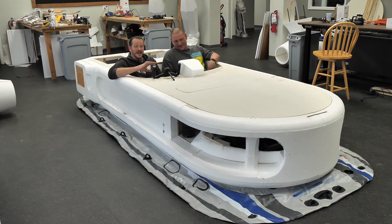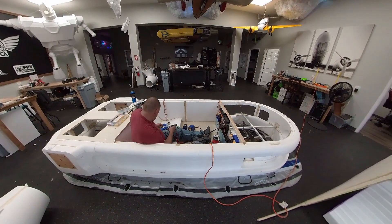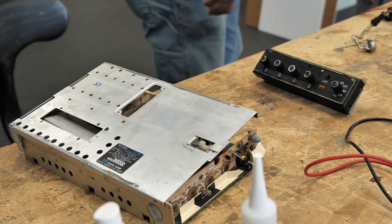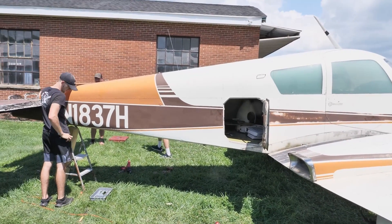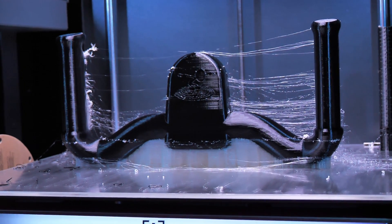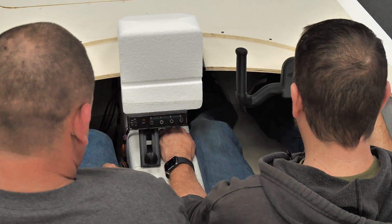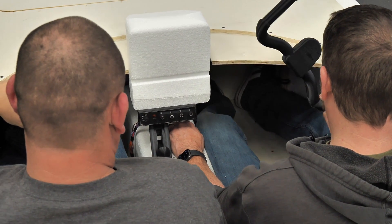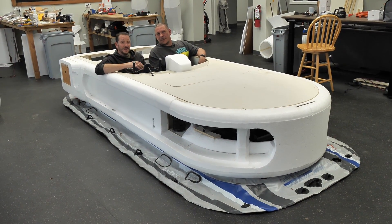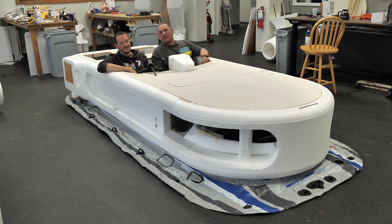Alright, so we are closing another week here. It may not look like a lot's been done, but a tremendous amount's been accomplished. We got all the wiring done for the bag lifting and hovering. We got a new screen. Dave worked really hard to repurpose an old transponder unit from our Cessna 310 to make it our control unit, which will control the bags, the blower motors, and the emergency shutoff. There was a lot of 3D printing and a lot of small stuff done this week, but it's all part of the process. Make sure you guys hit the subscribe bell because next week we're going to start putting the finishing touches — everything is roughed in, and now is where everything starts taking its final form. We're going to start getting the hard coating on, putting assemblies together, and taking this from an RC hovercraft to a hovercraft that we can fly. That starts as soon as next week — hit the subscribe bell and we'll see you next time.